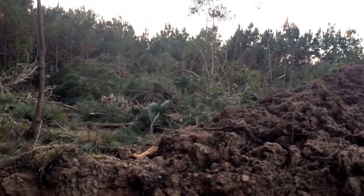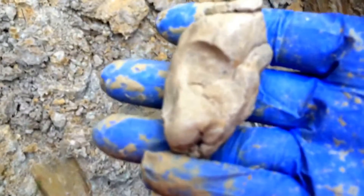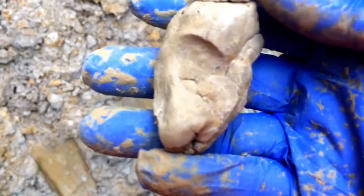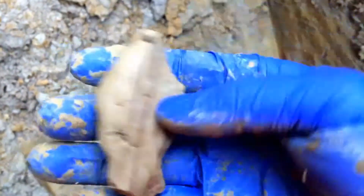I'll jump down here and do a little dirt test and see what it looks like. The excavator has moved on — he's going to get me another hole over there and another hole over there so I can get three good representative samples of what our material is going to be coming out of this pond. What we're looking for is a clay or material that will hold its shape when you squeeze it into a ball.